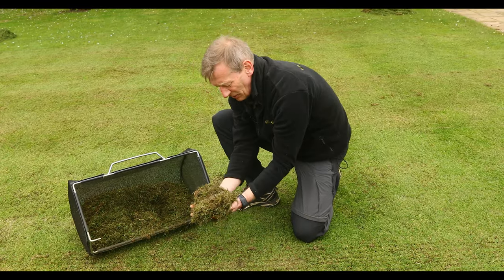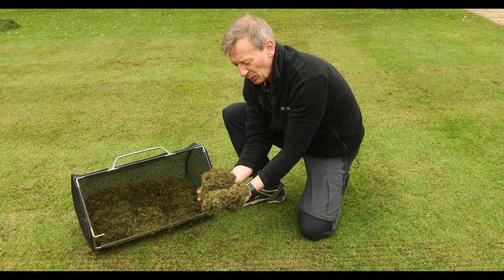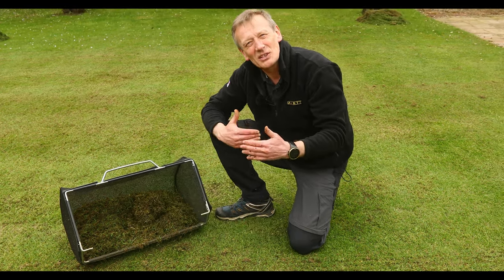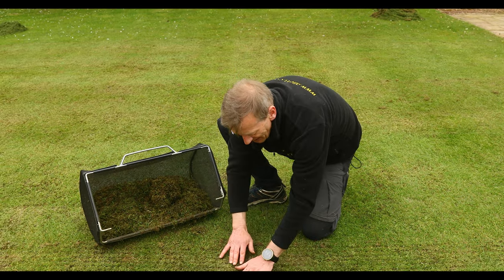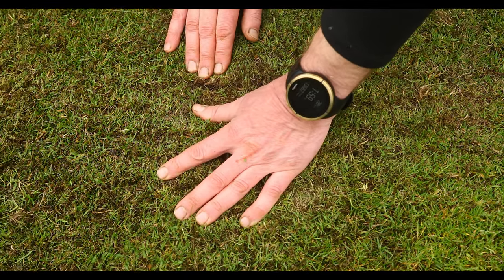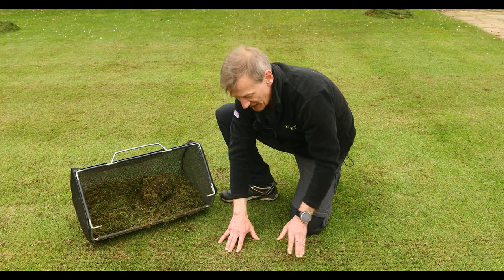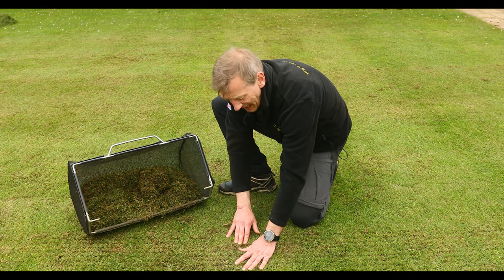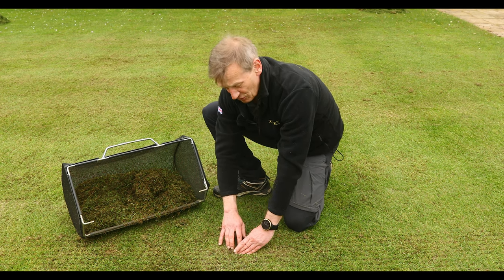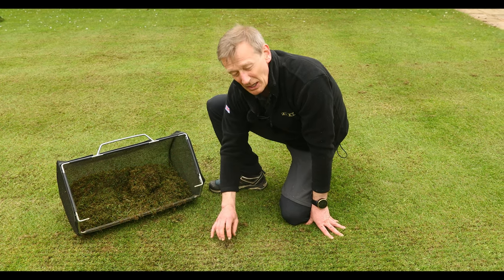You can see here the material that's come out from the verticut. Compared with the scarifier, which really just brings out the loose brown material — whether it be moss or thatch — this is pulling a few plants out as well, and that thinning process gives the plants space to breathe. Looking at the slot itself, especially in the Sterling where we can go 10mm deep, you're getting a very significant slot into the thatch, allowing it to breathe and enabling CO2 exchanges in the soil. This extra depth with the Sterling really creates a great environment for grass seed to germinate — much better than on the surface — and it keeps the seed away from the birds too.